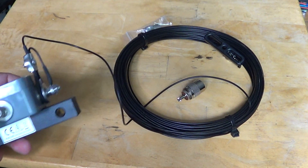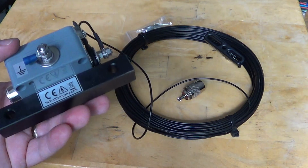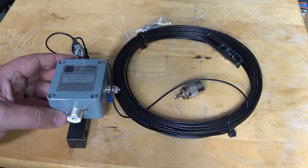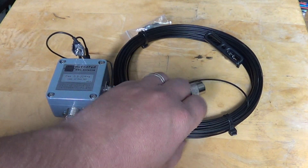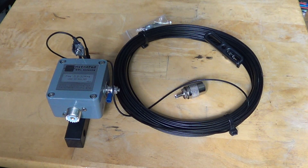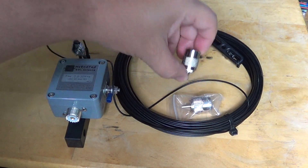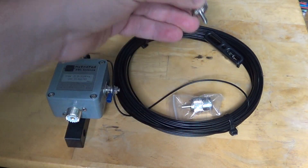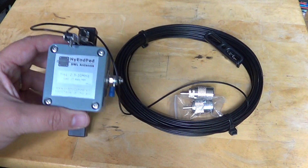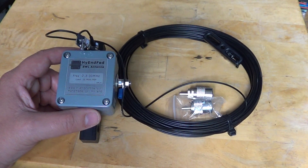This is a shortwave antenna you can buy online. It comes ready-made — all you have to do is install it, and it's easy with clear instructions. Basically you've got a 22-meter wire antenna rated in hard copper, capable of holding up to 40 kilograms before snapping. It comes with two silver-coated connectors and this box, which is a UNUN — one side of what we call a balun.